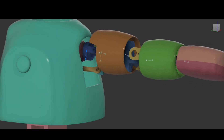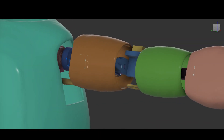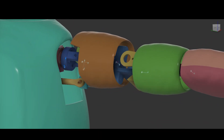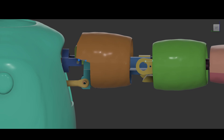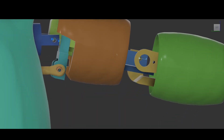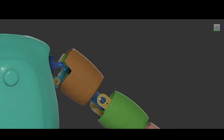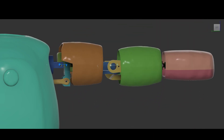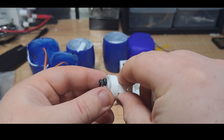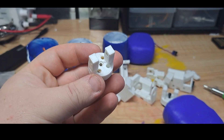BonBon's arm has two ranges of motion: tilt and rotation. The rotation is easy — you just attach the arm onto the top 25 kilogram servo and when it spins, the arm will spin. For tilt, the second servo will push and pull it, and when these two work together it can completely mimic the shoulder's rotation. That blue component attaches to the servo using a metal servo horn, and there are heated inserts in the part so I can screw it directly into it so it doesn't lose connection.